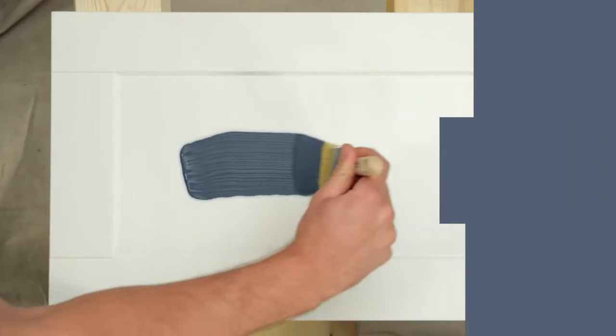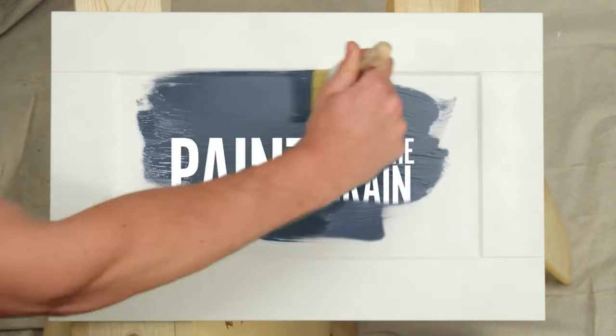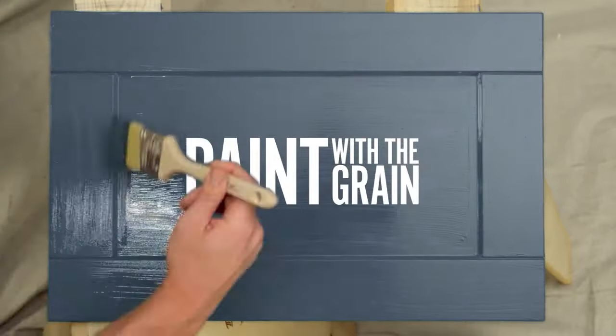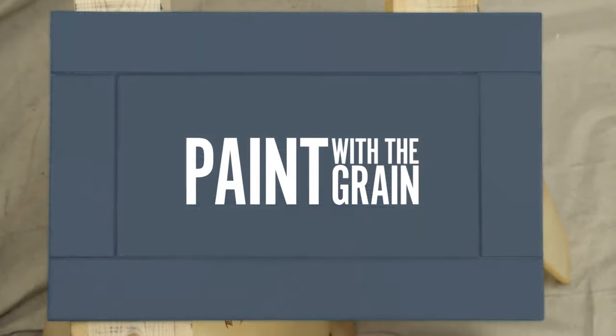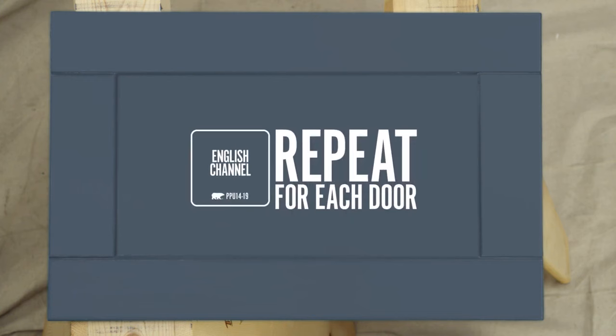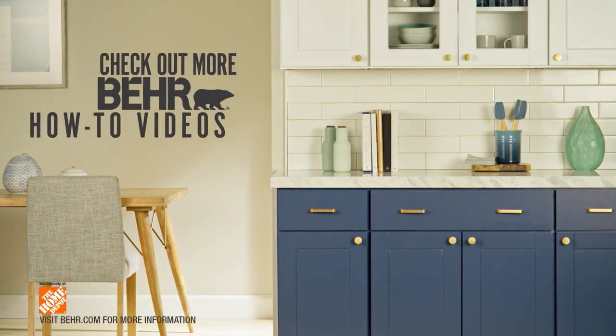Starting from the middle and working your way toward the edges, paint with the grain of the cabinets, making sure to get a consistent, even coat. Once the paint is fully dried, we suggest adding a second coat. And don't worry, the paint will smooth out as it dries. Repeat this step for each of the cabinet doors, and you'll be enjoying your new kitchen in no time.